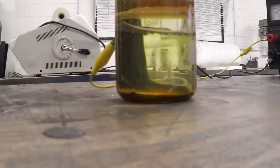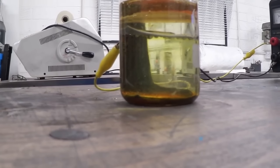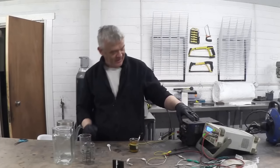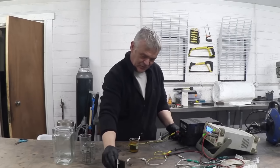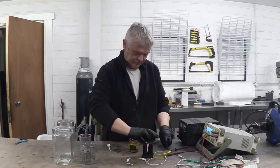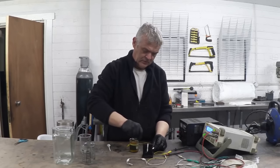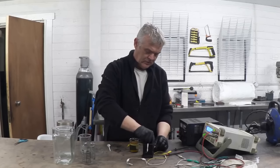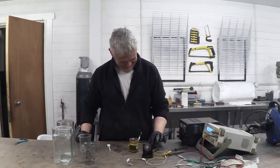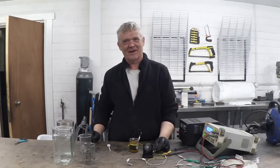After about 10 minutes of charging at 7 volts — higher than ideal, but for demonstration — you can see the bromine collecting at the bottom: that golden brownish colour. Above it is the layer of oil. Let's see if we can get anything out of it — the voltage should be about 1.8 volts. Connecting it up to the little motor — and there we go! The motor is spinning away from our zinc bromide gravity battery.